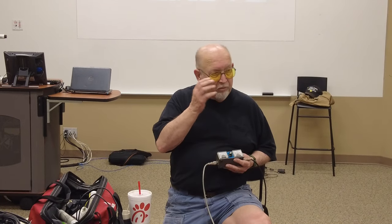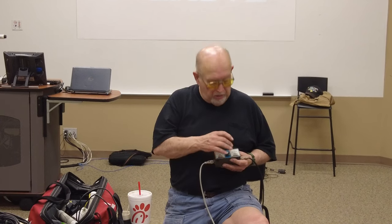I'm sorry, I said that backwards. On HF, if it's under 3, you're fine. On VHF, under 2, and I don't play with UHF, so I couldn't really tell you, but I'd say probably 1.5. Now, a 3-to-1 SWR on these transistorized rigs will cut the power back a little bit. You may not get 100 out, you may only get 75 or 80. They do that so you're not heating up the transistors. So I wouldn't stay with 3.